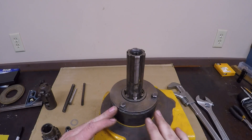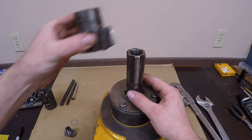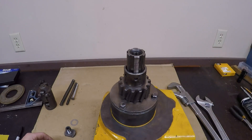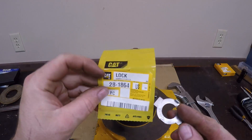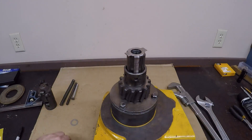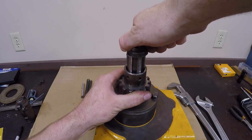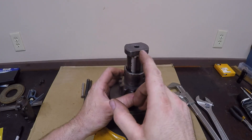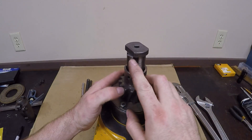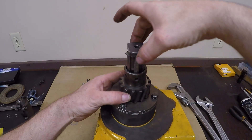Now it's time to set up the pinion — this part takes a little bit of trial and error and some forethought. I'm not going to bother with putting the kickout springs in yet or the plunger. Just start by choosing a position to install the pinion gear — it can go on the shaft any one of six ways on these splines, so just pick a spot. You have the latch nut and a new 2B1864 fold-over lock. Set that lock down, the two small tabs go in the splines, then start the latch nut and run it down to see where it's going to end up. When the latch nut starts to contact the lock, you want to see where everything is — you've got two flats on the nut and ideally want the two fold-up tabs in the middle of those flats.